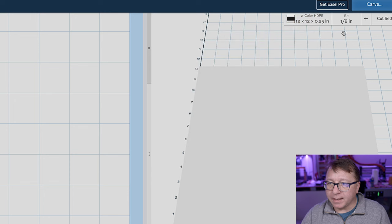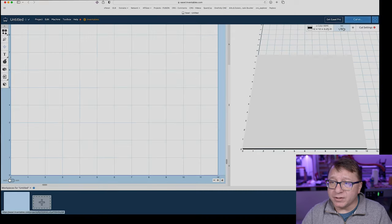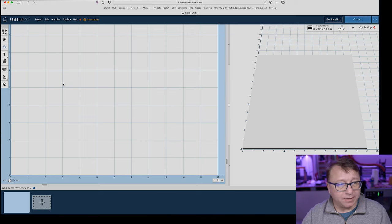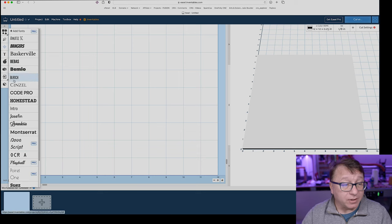I'm going to stick with the stock 1/8 inch bit, but we will change the cut settings later on. On the left-hand side is the canvas, and on the right-hand side is the preview of your CAM. I'm going to click Text here. You can see there are a couple of different fonts — some require a pro license and some don't. If there's a font you want to use that is not in Easel, I would recommend you take a vector program like Inkscape or Affinity Designer, do all your artwork in there, and then import the SVG into Easel. It works just as well. I'm going to do this tutorial entirely in Easel to show the end-to-end process.